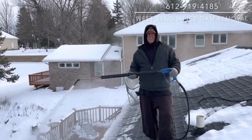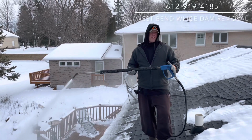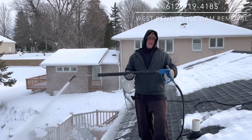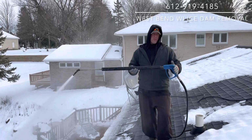Hello everyone, Jesse with Absolutely Clean coming to you here from West Bend, Wisconsin, and we're removing ice dams today from this roof with low pressure steam. We're using low pressure, not high pressure. We do not use pressure washers on roofs, and we highly advise homeowners to avoid them.